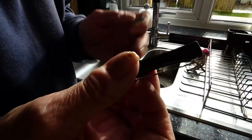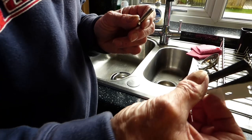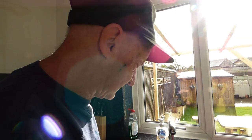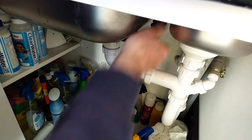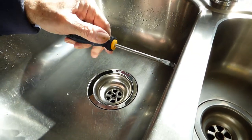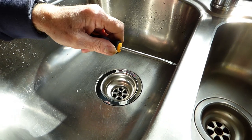We don't need this extra bit - it's for different types of sinks you might come across. The metal spacer and another thicker rubber washer depends on what your sink waste is. We need a tight fit - there's not much gap up there to get that overflow fitting in, so that one's quite wide enough for us. Line it up, put the screw in, and hold it in the right position with your hand so it doesn't flip around as you tighten it up with the screwdriver on the top. Tighten it up - it pushes the washer in nicely.